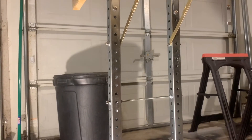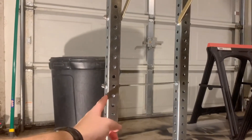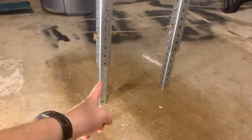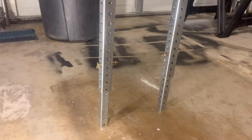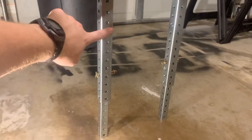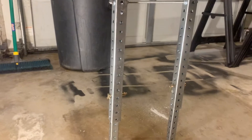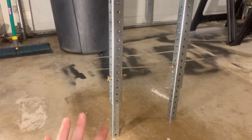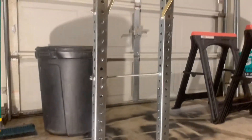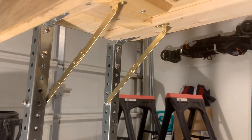For the legs, I bought two three-foot sections of the inch-and-a-quarter outer tube, and one three-foot section of the one-inch inner tube, which I cut right in half. So I've got 18 inches of inner tube, and I cut the outer tube at 28 inches. I figured 28 inches is probably safe — if I have to push the inner tube all the way up I should be level or close. I use these little leg supports that I got at Home Depot — they weren't expensive, about five or six bucks — though it took me quite a while to figure out how to mount them correctly.